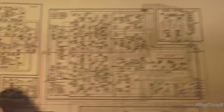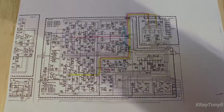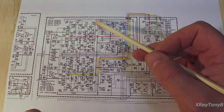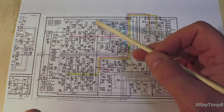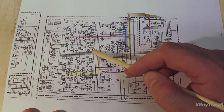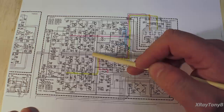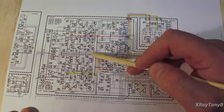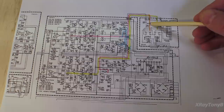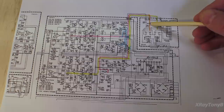Here's a bigger view of the amplifier section - you can see right and left channels. If you look at it at face value, this just essentially looks like a regular class AB amplifier. You have push-pull with your NPN section handling positive rail voltage and your PNP output transistor for the negative rail voltage, current limiting resistors, and the center part that eventually finds its way out through the Zobel network into your protect relays, and out to your speaker terminals.